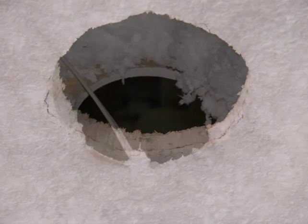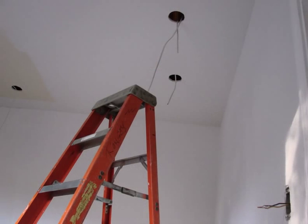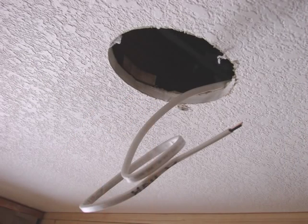The wiring should be secured into the attic area, stapling about every three feet. Put in your loops from fixture to fixture location, and now you're ready to go ahead and prepare your light fixture.